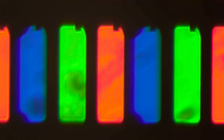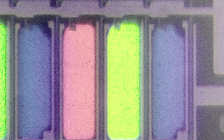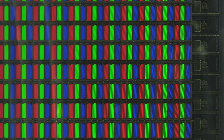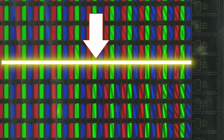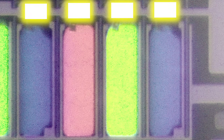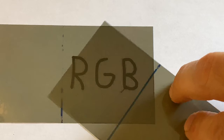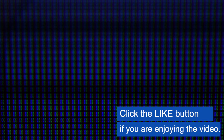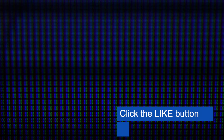You can see the data lines coming down in between each sub-pixel. The timing needs to sync so that when a specific row is on, the data is sent at the same time. While that row is on and the correct voltages are being applied to the liquid crystals, those tiny capacitors are also charging up like a battery. Each capacitor keeps those crystals bent at just the right shape long enough until the transistors turn on again to receive new image data. So the darker bands caught on camera are the fading of the charge on the capacitors before that row gets refreshed.